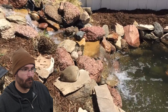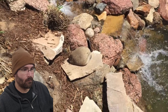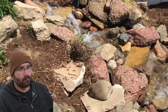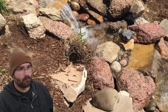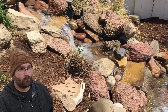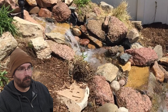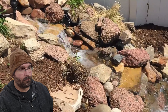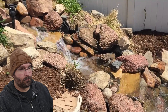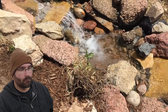The homeowner made a quick video of the waterfall liner install job before tearing it apart. They had a contractor come in and they've been losing a tremendous amount of water, basically blaming it on everything from evaporation to faulty equipment like the faceplate liner on the skimmer box — which was not the case. It actually ended up being a botched job with a bunch of double-sided tape and a sliced-up liner that wasn't installed properly, causing it to leak — and now they're finding even more issues.